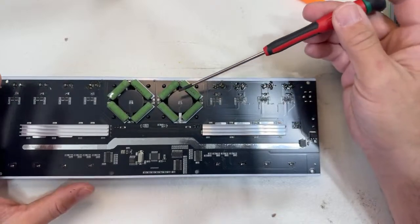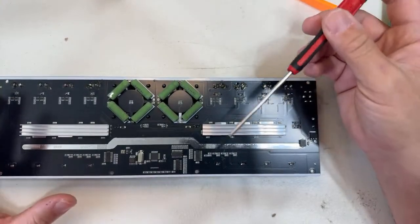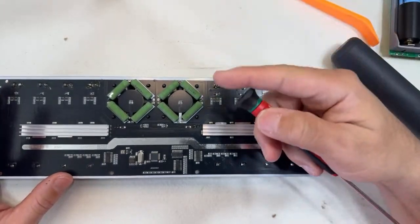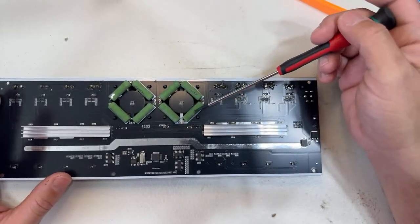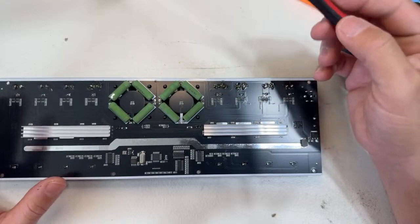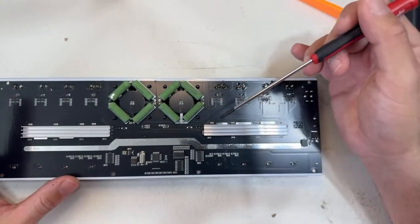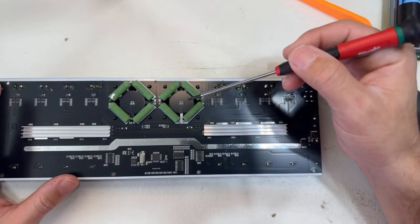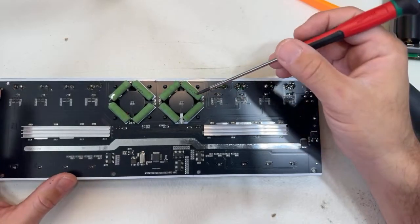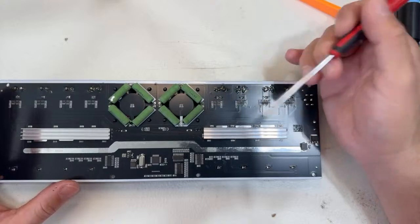So we have these resistors which are going to be able to drain about 1 amp per cell. However, remember, because this is not made with a MOSFET for discharging, it's not going to be completely accurate 1 amp. It's going to be plus or less. When the battery is changing voltage, the consumption is going to be less and less. We estimate it starts with 1 amp discharging, and when it's going by 3.5 volts, it keeps decreasing to, let's say, 800 milliamps. So it's not good for what we call constant current capacity testing, but it's excellent for capacity testing. We can know approximately, it's not going to be 100% accurate, but we can have a very good idea how much capacity we have in the batteries.